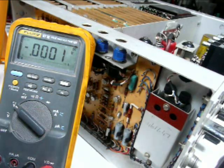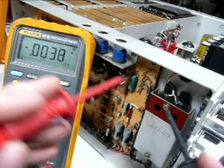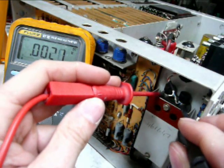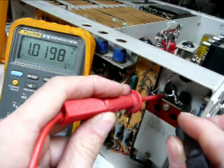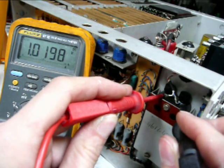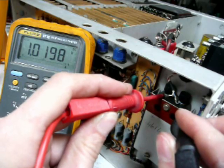We'll just check what state the voltage reference is in. The normal voltage of this is 1.019 volts, so we'll just see what we get. 1.0198. Considering this is about 47 years old, I think that's not bad long-term stability.